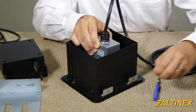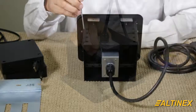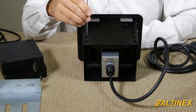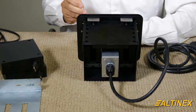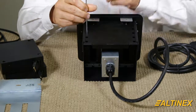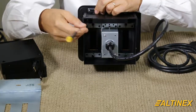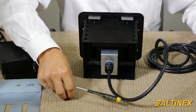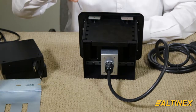We'll do the same thing on the other end. These screws need to be inserted in a location that's a little bit recessed, which may make it difficult. You can either use a magnetic screwdriver, or just use a screw and put a little piece of paper in between — that will hold it nice and tight. Once you put it in, push it right through and tighten it down. Remove the piece of paper afterward. There's always a way: if you don't have a magnetic screwdriver, just use a piece of paper on the screw and it will hold it just like a magnet.